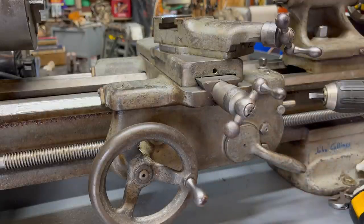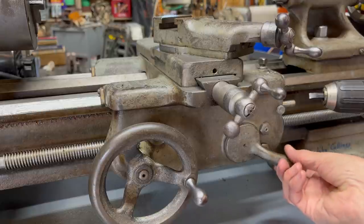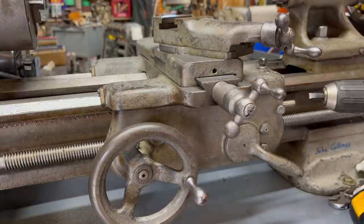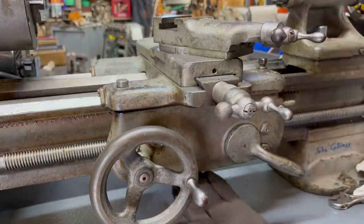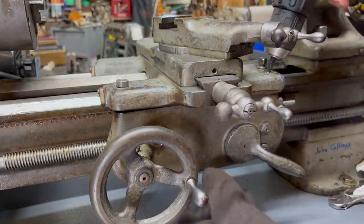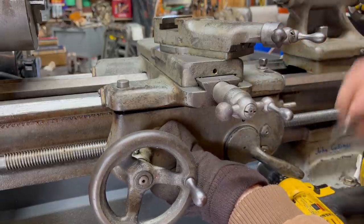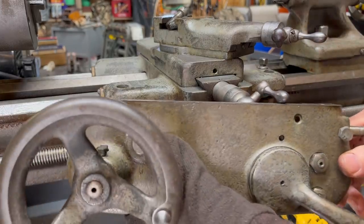It's not all that heavy. Some machines may have dowel pins on there as well. Remember the lead screw passes through the split nut, the half nut, so I think I need it in that position so that it'll pull right off — if not, I'll be able to feel that as I remove these screws. And you can see it already dropping off. Yes, it pulled right off.